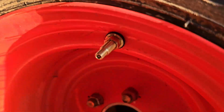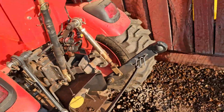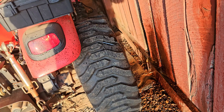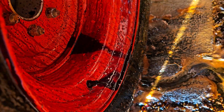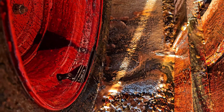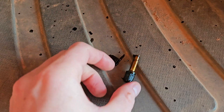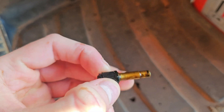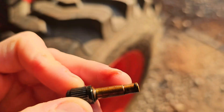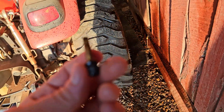There goes all the beet juice. It's under jack because that side's being fixed, so I can't turn the tires and I can't hold it by myself — I just lost all my beet juice. That's what I replaced it with — all brass. These things should come with metal valve stems. Look at that rubber. The core blows out. Look at that, sprayed everything on the tractor. That's what blows out — the core. As soon as you try to grab hold of this cap and twist it, the inside core that's in that rubber valve stem blows out and you get a face full of beet juice.